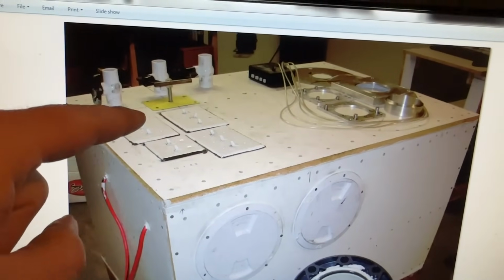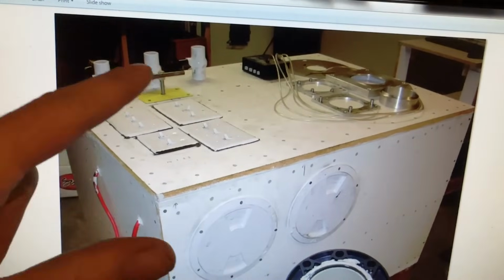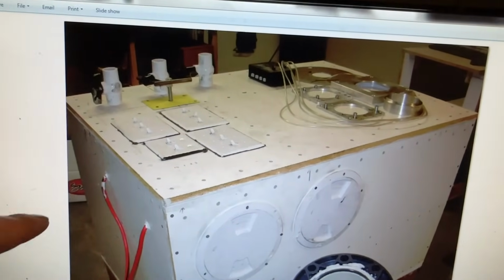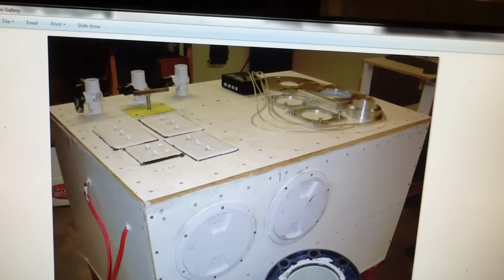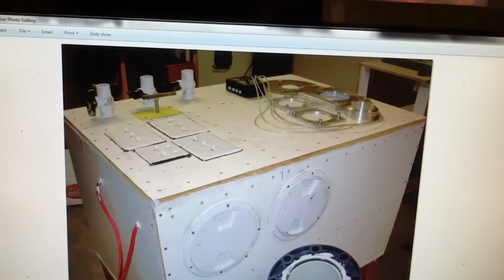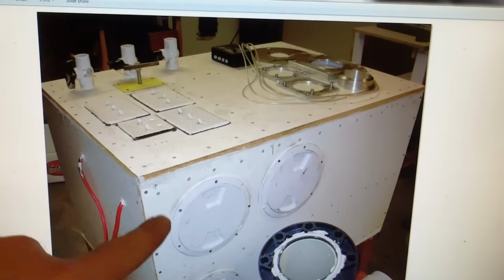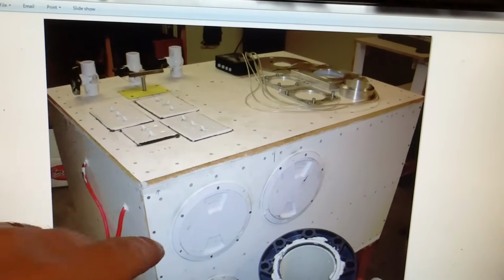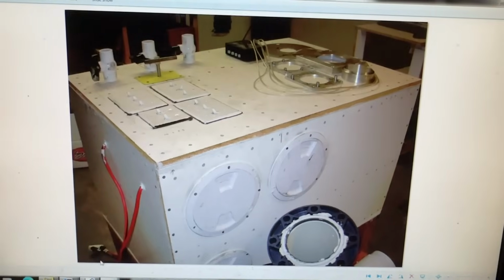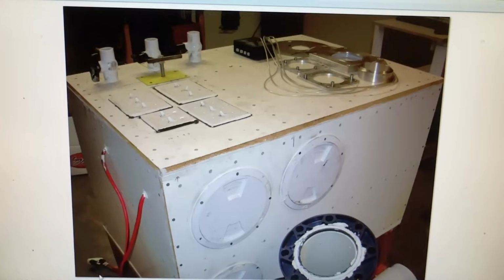And then if it wasn't pulling enough vacuum, I'd crack them open again, turn on another motor, and then I'd close them. So it's bleeding off the amount of vacuum that it was actually pulling. It worked phenomenal. Loved it. Used up a whole lot of air, but it had a lot of great capacity. I will say this, I imploded this. This was like the third iteration of that box I made, because the first two I actually imploded, where it had pulled so much vacuum that it collapsed. So I had to build a whole skeleton on the inside. The thing weighed a ton.